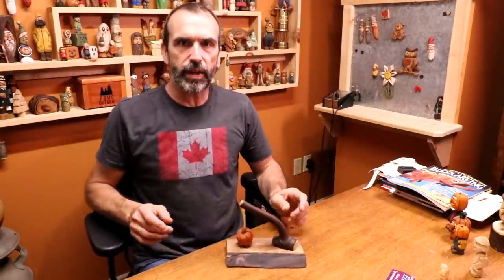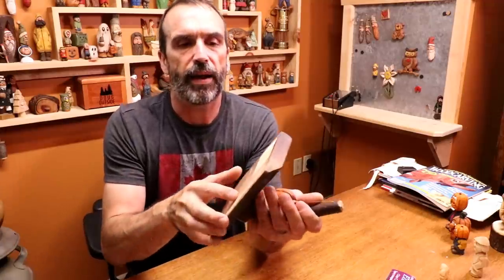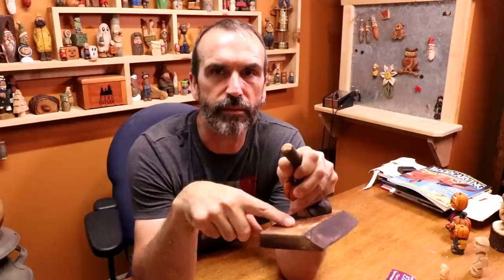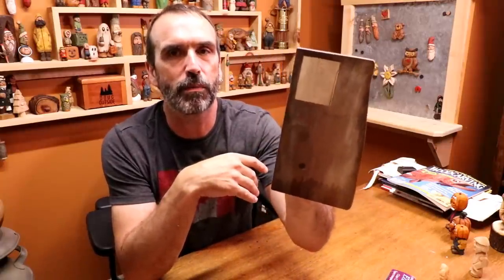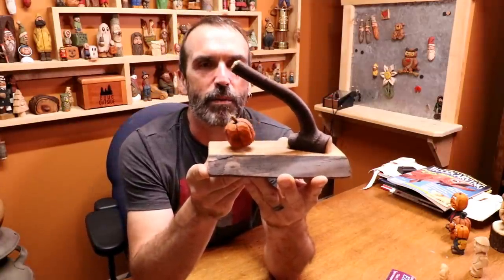The trick was getting the magnets close to the surface without showing them. I used a router with a half-inch flat-bottom router bit and kept going down a little bit at a time until I left an eighth of an inch of wood. Then I glued the magnets in, so they're only an eighth of an inch under the surface of the walnut. I didn't want to get another piece of walnut, so I just put a chunk of maple in the bottom — you're not supposed to look at that — but I thought it was so much fun.